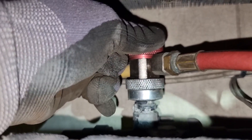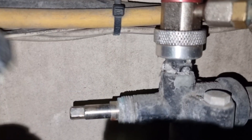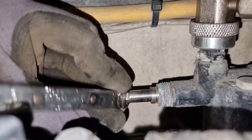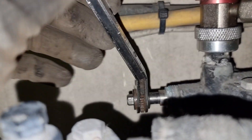We need to check if it is real refrigerant or purely air. I have attached the discharge hose to purge the system and check whether we have freon or only air. I purged the air and stopped once refrigerant was the one coming out.